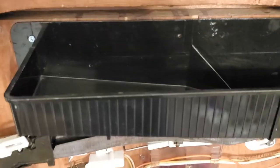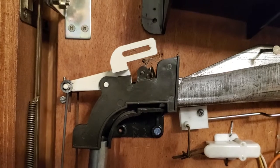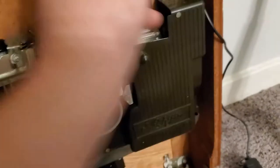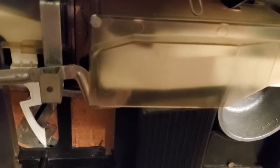Basically what's going to happen is your jackpot balls are going to be stacked up in this back hopper, filter down this tin channel, and then there's a contraption that actually lets balls come into this bottom hopper. As the two white pieces here are not fully depressed, you're going to have balls that end up in here, and then overload balls that end up in this hopper. Balls will pay out of this tray, and it basically tilts as you get jackpots and releases them down this channel out to the front of the machine.